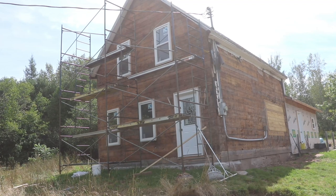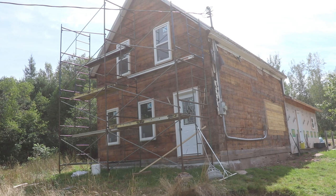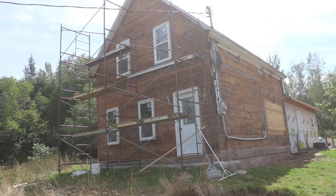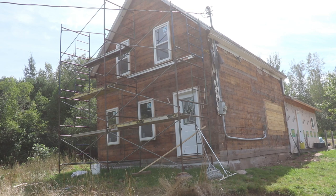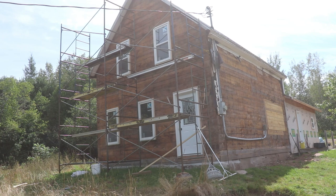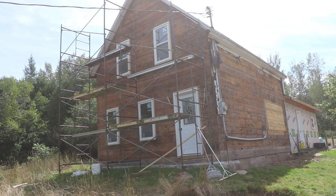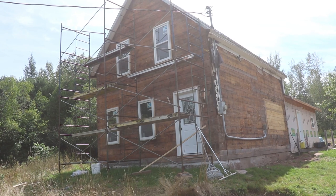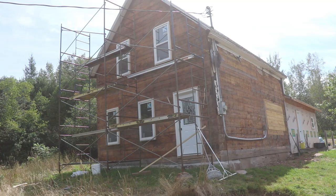On the front side, same thing — we've got all the old siding off. There was vinyl, some old masonite siding, and some of the original boards. All that's left to tear off is a little bit around the entrance. All the windows are out of the old house now and changed over to new ones, and the doors are changed too. We're re-nailing the old outside boards — I took it right down to the board to make sure everything was good and to work from a nice flat surface. Some of those big wide boards only had two or three common nails in them, so we drew them in with an air nailer and three-inch coil nails, which makes a nice flat surface to work on.